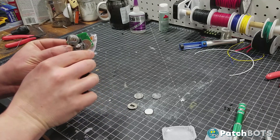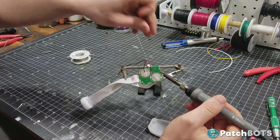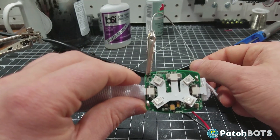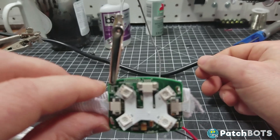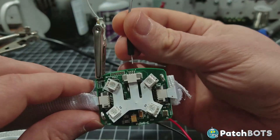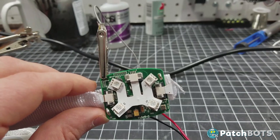The first thing I did was get rid of those battery terminals. The batteries are probably dead, and I don't plan on using the terminals anyway, so I just hacked those right off. Next, I soldered a ground and a positive wire to the old battery terminal. We have power going to the back of the wristband from a dedicated DC power supply at six volts, which replicates that battery series. Now all we need to do is short out these pins to see the colors. I have an alligator clip attached to a ground pin, and if I start touching this to the pins, we should see color — pin one is blue, pin two is red, and pin three is green. The wristband works.